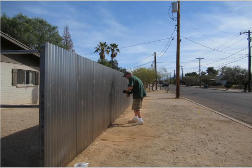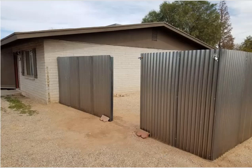It's not good. But one thing to note on the corner there, you can see the end curve, so it's curving down on both sheets. And it makes a fairly nice corner there. You could see other styles where if the post had been visible and they had done the cross bracing on the other side of the post, and they would then set the corrugated metal so that it would butt up against the post. You can see how that would be a very different look. And you're not really worrying about how those corners are looking, but we decided we wanted all the posts to be non-visible from the outside.